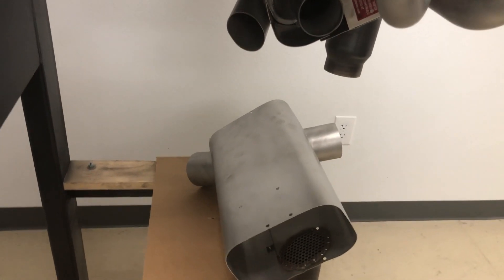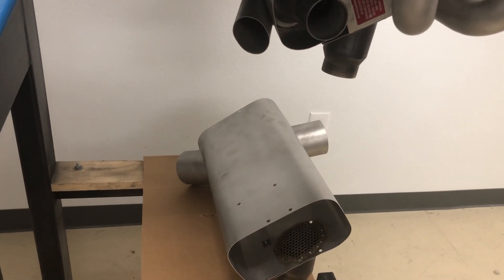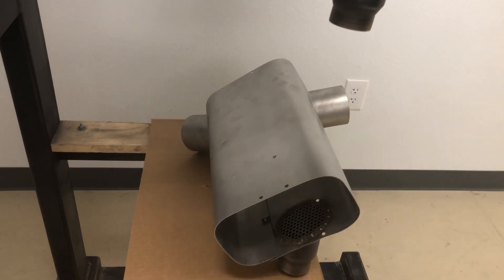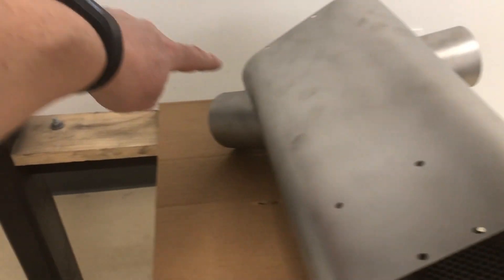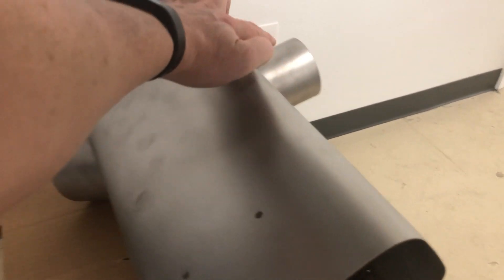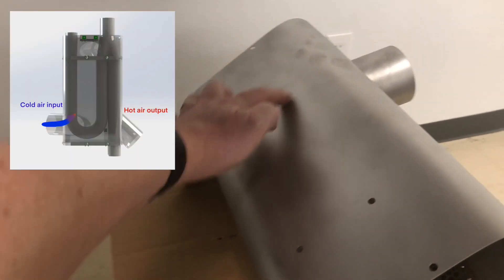It's taken us a long time because we didn't have much room to work with, but we finally hit the aha. The major difference is the original power flow exhaust system had an input right there going through the forward baffle, and the output was right there. The problem is the air would come in this way, kind of come through and take the shortcut — it missed this entire section over here.